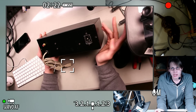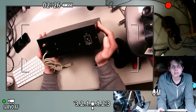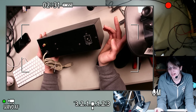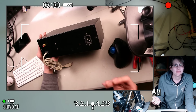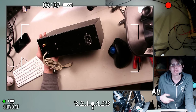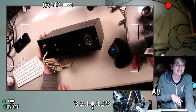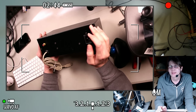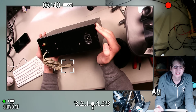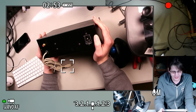And in fact, if you look at the way hubs work in USB 1.1 with full speed and low speed, basically the hub has to switch the entire upstream bus temporarily into low speed mode. So when you plug a low speed device into a full speed hub, you're actually, during the duration of that low speed packet, slowing down the entire bus. Which isn't necessarily all the USB ports on your computer, it's just that particular full speed bus is slowed down. Anyway, USB is full of weird gotchas like that.